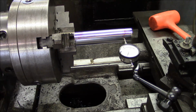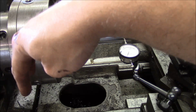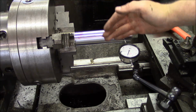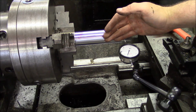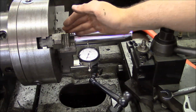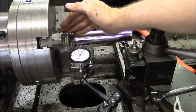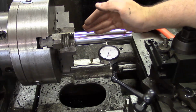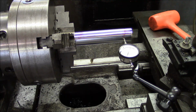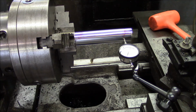Okay, I think I've got it where I want it. The alignment has been made, and I've bolted it back down secure to the bed. So I'll take a sweep with the indicator here, and maybe you can see what I'm seeing. So right now it's at about +0.1 thousandth. Down to -1. So -1 to +1. So that's 0.2 thousandths on the radius, which should get us 0.4 thousandths on the diameter. So I'm going to put everything back together and we'll take another cut.